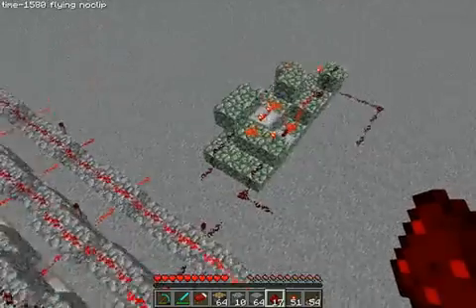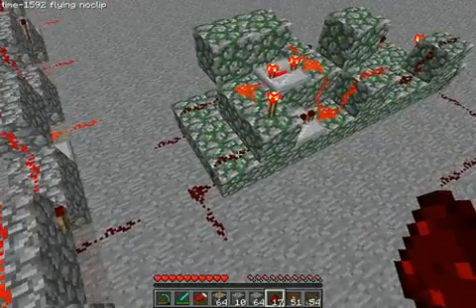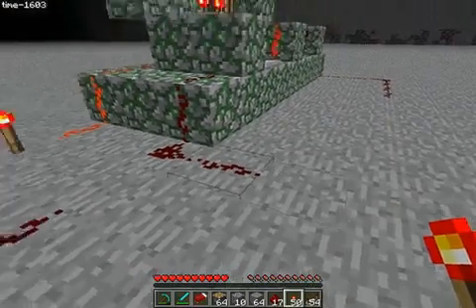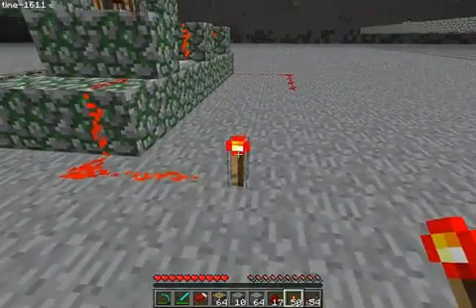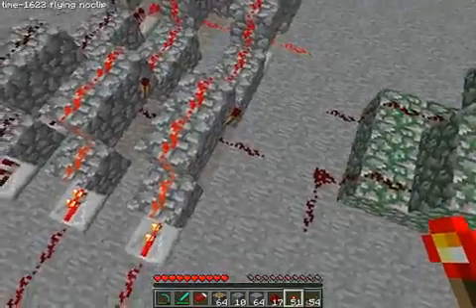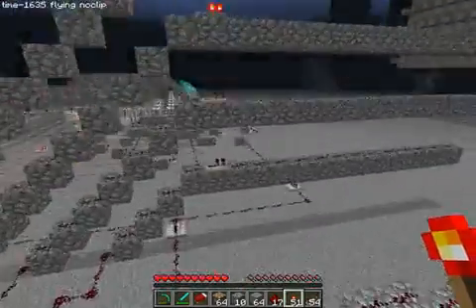Now, the way this is going to be hooked up — this is the edge-triggered flip-flop we'll be using, and this is the enable, that'll be connected through to here. Whenever this goes from light to dark — a falling edge — it'll save a value. So, falling edge saves a value. When it was bright there and it had a falling edge, that became bright — that's the value that'll be saved. This value here from the decoder is going to act like the enable, or the clock. And this value here is going to come from this.